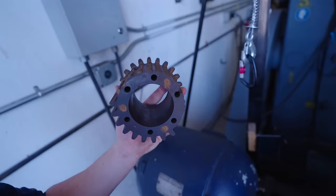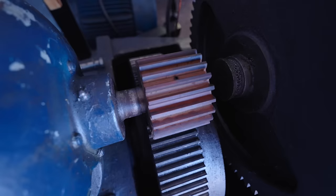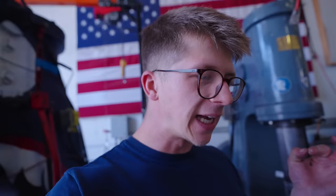The Mycarta gear that is designed to be a weak point has broken. We sourced another gear, custom-made, and it broke after 30 seconds. The machine all feels good inside, but that last gear — we think it was cut in the wrong orientation, so the teeth were a little bit unsupported and teeth broke off. So we've got to get another gear. I can't use the Chambersburg, which is devastating, because I would love to use it once more while I still own it. Oh well.